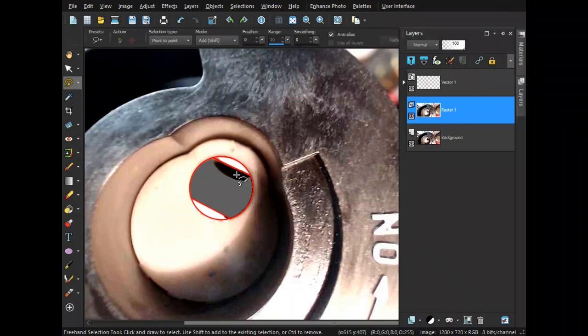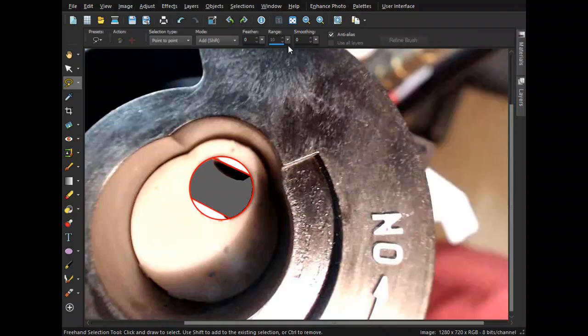65 cases in a row, empty of all powder. And it's because the powder is basically just backing up in that little slot, and it can't fill the charge bar. So my thought was I would try getting a second one, which I actually have a second one now, and modifying it.